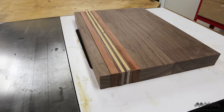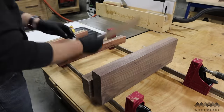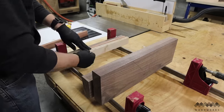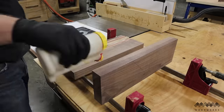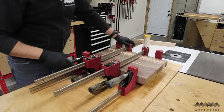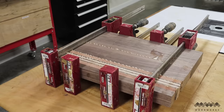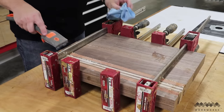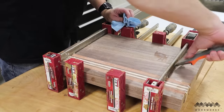Man, that cherry has such a sweet color. To glue up the board I'm using Titebond 3, which is suitable for applications where water will come in contact with a finished product — though I've used Titebond 2 in plenty of cutting boards without any issues. A foam brush works really well here — cheap and disposable. Once everything is lined up I apply pressure with the clamps and get a nice glue bead at every joint. After about 30 minutes the glue is skinned over, and tip number three is to wait until the glue is skinned over before cleaning up — it makes it super easy.